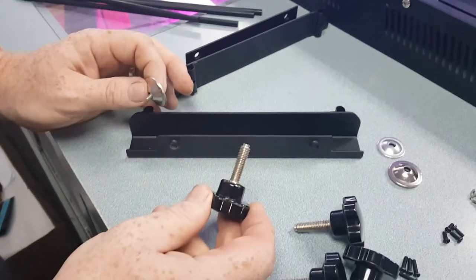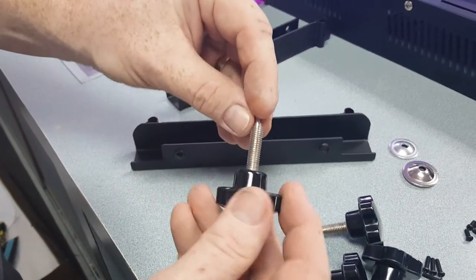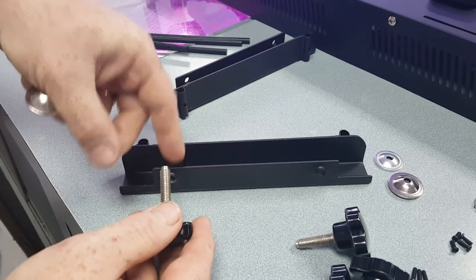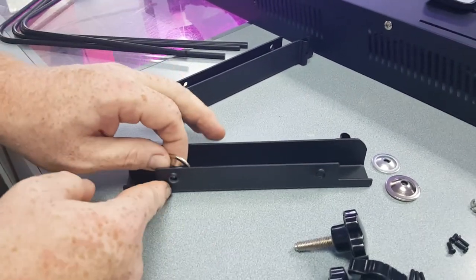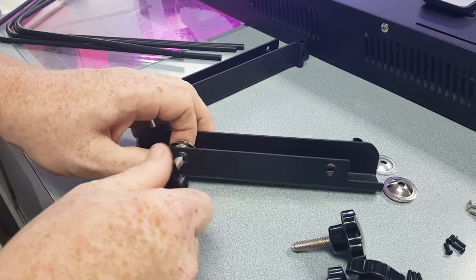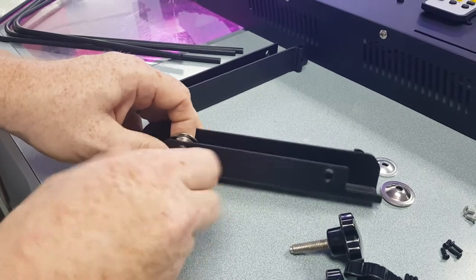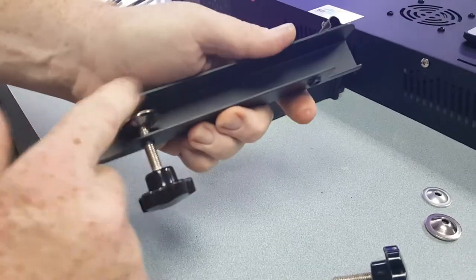There's a trick to getting the tightening adjustment rod put together. The small screw is going to screw into the end like this, and that's going to hold the foot — the foot should be able to spin freely. If you put the rod through first, you'll never be able to get your finger in there to attach the foot. So the trick is to go ahead and push that screw through the hole in the adjusting foot, slide that through the hole in the bracket, then take the rod with the threaded end and thread it onto the screw. It only needs to be finger tight — this isn't a moving part that's going to come loose while sitting on the tank. Once you've got it finger tight, start threading it in, and it should go all the way into the bracket. Now you can adjust it and it spins.